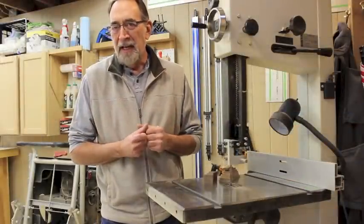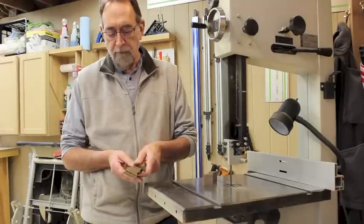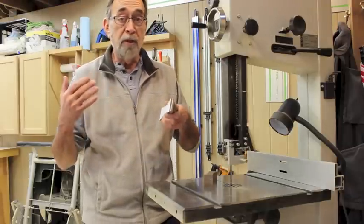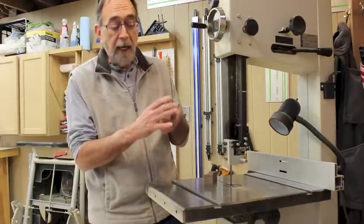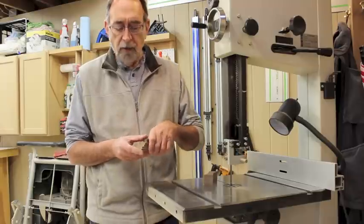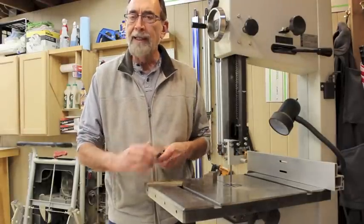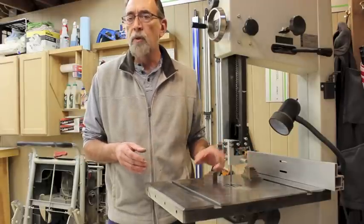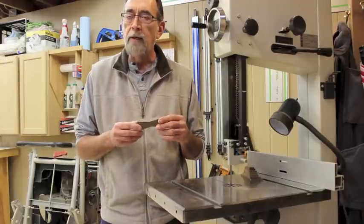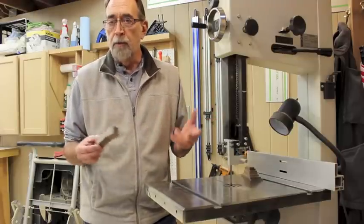There's really nothing magical about designing a bow tie key — there are just a couple of things to keep in mind. Some time ago I made up a bunch of bow tie key templates. I spent time drawing these out on graph paper using the golden section, figuring out the angles, sizes, and everything. When everything was said and done, I decided they looked a little too machine-made. I still use these to lay them out on the cracks on the slab to determine what size is going to look best, but when it comes time to really cut them, I sort of just draw them out on the wood freehand using a straight edge. Like a hand-cut dovetail, I want them to look more natural and not machine-made.